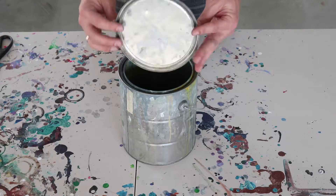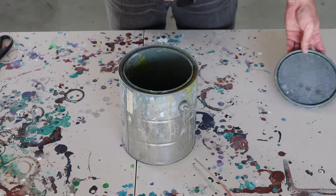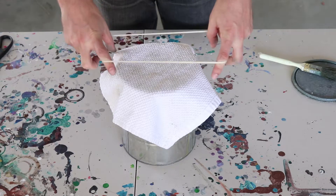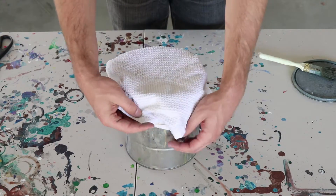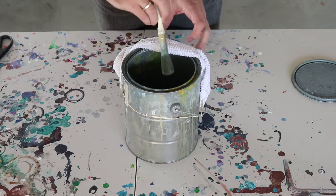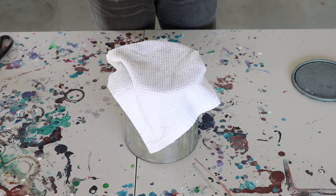One reason I like to use the paint can is because you can use the lid to contain the actual spirits and the vapors for when you're not using it. But if you want an above and beyond bro tip, I recommend grabbing a loose rag that you're not going to need and a rubber band. Put the rag on top, put the rubber band around it, and pull up a little bit on one corner. So when you need to reach in, just pull the flap back of the rag, dip your paint brush in, clean it off, and then put the rag down. This will help contain some of the paint thinner vapors — a really good tip for somebody who might be painting in a not so well-ventilated area.